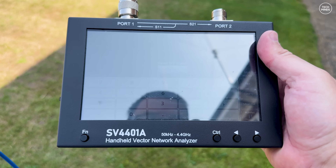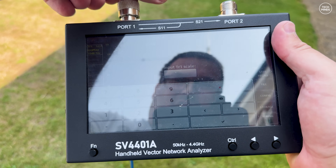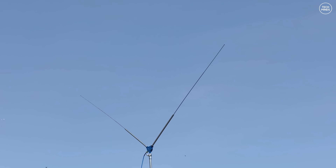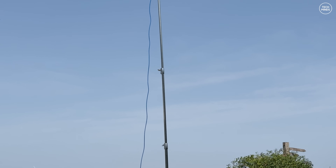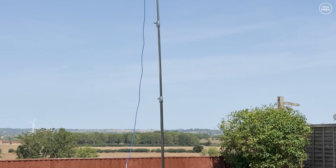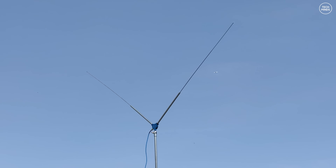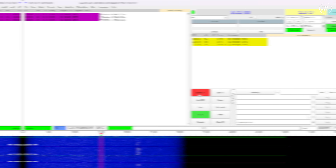Before heading inside to the shack I wanted to test the SWR. After a little tuning I got the SWR to where I wanted it and put the antenna back up. Note that the resonant point does change slightly as you raise the antenna further from the ground. When it comes to testing HF antennas, it's very difficult to provide a review that works for everybody — propagation, location, antenna height, surrounding buildings, and even soil type can all affect how these low-band antennas perform.